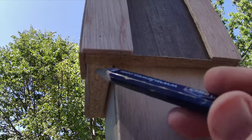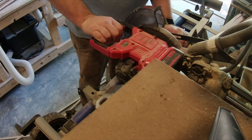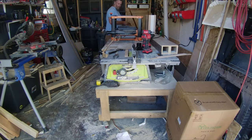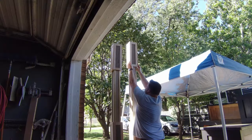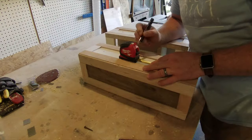To decorate the towers a little bit, I had some leftover decking material — a couple of deck boards I could run through the table saw to make strips. I had some leftovers, so I cut those up, ran them through the planer, and sanded them down to make trim pieces I could attach to the outside edges of the front three faces of the tower, giving it a more finished appeal. We were really going for a Disneyland restaurant on Main Street kind of vintage but clean look. I also decided to buy some conduit that would span the gap between towers so I could hang a sign from it and paint up the poles.